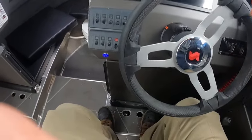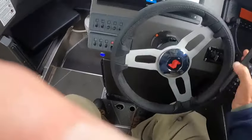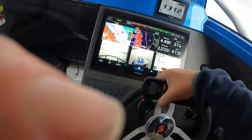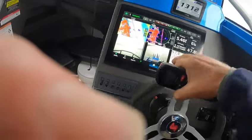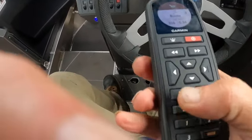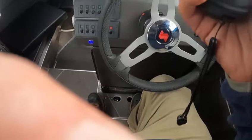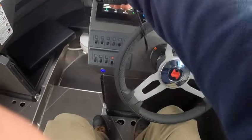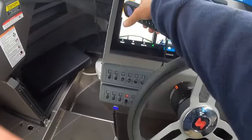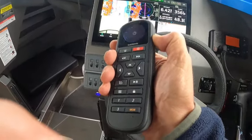So there you go. Number three — I think that's the one I need. I'm going to straighten this boat up again and hit heading hold. There it is. Then I'm going to hit number three — I think that's follow route. Yeah, follow route. Then you have to hit three again to activate the route. Now it's following the route again. I'm going to shut that autopilot off — standby. If I want to engage it I hit this, but now I hit this button to shut it off.